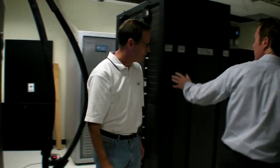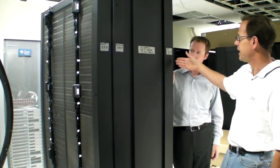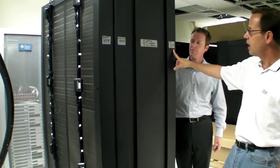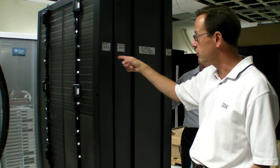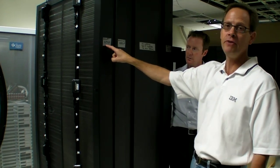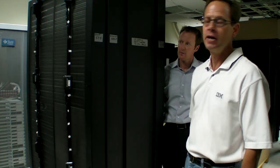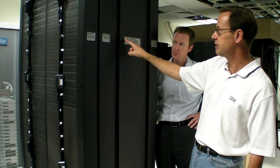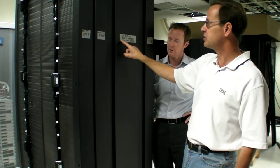You've taken some measurements here in advance of this video — do you want to talk about some of those? Sure. For this particular setup, the air temperature coming into this rack is at 71 degrees. The server exit temperature measured right through the door is at 100 degrees. Coming out of the rack, it's actually dropped the temperature down to 57 degrees. So 71 degrees in, 57 degrees out — and that's for this condition at 15 gallons per minute, 50-degree water temperature above dew point, and a 16-kilowatt rack.